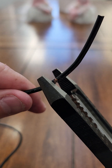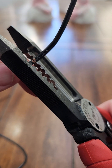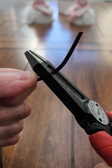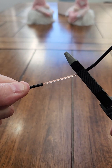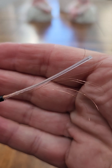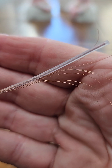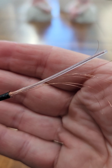Here I'm getting it partially out, and you can see the copper right there — and that's what you want to get rid of in the end, but it's a little bit difficult. So I did it. You can see that there's the copper wire there in the strands, but there's an inner wire that has a plastic sheath around it. That's exactly what you want exposed for the antenna.